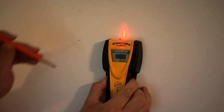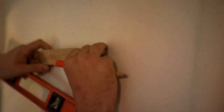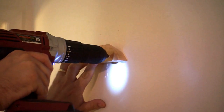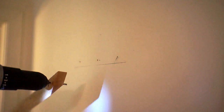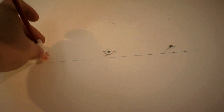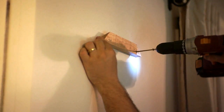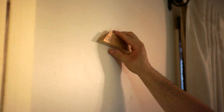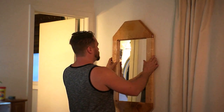To hang it on the wall I was finding where the studs were to see if I needed any drywall anchors. Turns out the stud was kind of off-center, so I can get one screw into the stud and then I had to mark the others for drywall anchors. To make sure the holes lined up perfectly, I made the holes in the piece of wood first and then drew them directly through onto the wall. I'm enlarging two on the left for the drywall anchor — the screw-in kind — and I did have to countersink the drywall anchor so the screws were long enough to get all the way through.